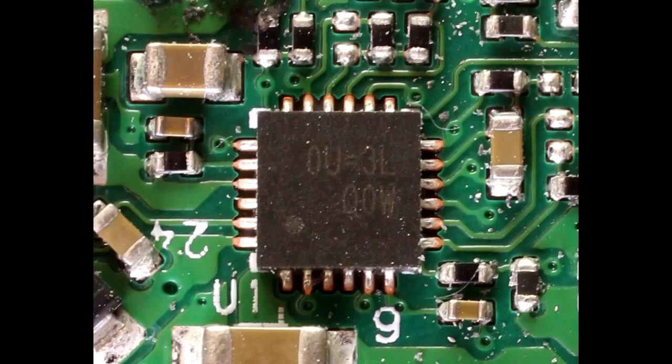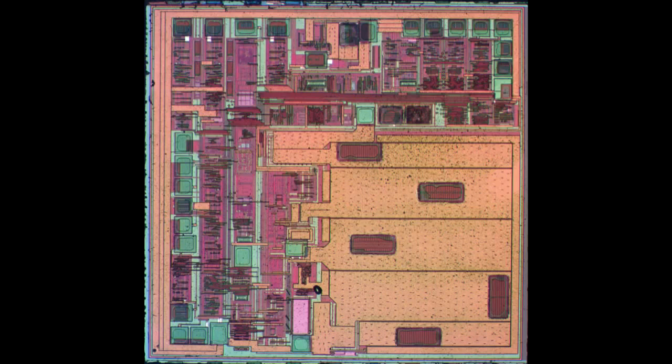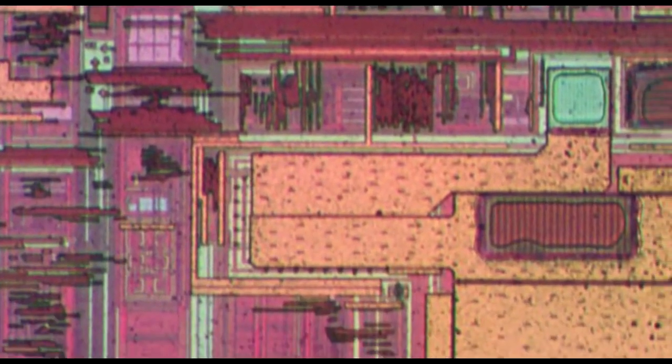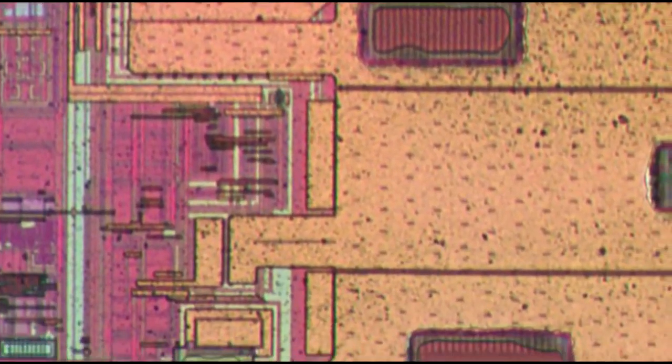Let's take a more detailed look at the actual controller IC. Here it is de-encapsulated. Large golden areas on the right are probably covering some large transistor structures, and a surprising amount of logic on this one — no surprise, it's a very modern part. The only identifier I can find on it is RT627A, but that seems to be a dead end when I search for it — I can't find any particular supplier. But it certainly does look like a very modern controller.